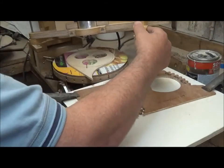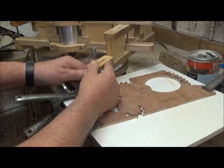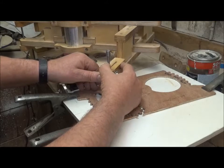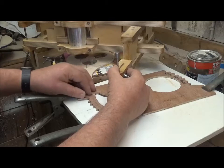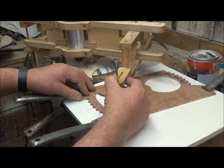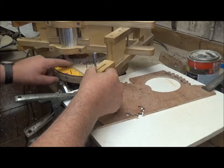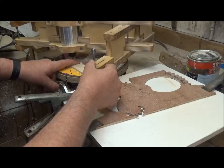For smaller pinions, it's best to cut just one tooth at a time, so you only need a template with one tooth on it. That was found to be the best approach for pinions. The router moves quite smoothly at a decent speed, and the cut is generally good. A great benefit of this method is that there's very little filing required at the end.